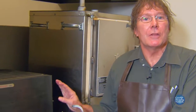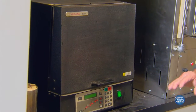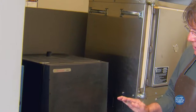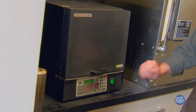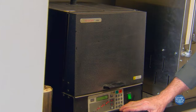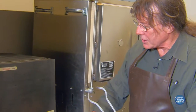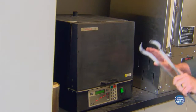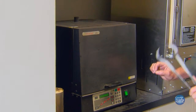We are at our oven. The flask is inside at a particular temperature. To burn out the wax inside the flask, it goes through a series of different temperatures for different lengths of time. It goes as high as 1,300 to 1,400 degrees — depending on what you're casting — which totally burns out the wax, leaving no residue. Then you bring it back down to around 900 degrees. We're going to be casting 14-karat yellow gold, and for the size flask we're using, a good core temperature of the flask is around 900 degrees. We're going to use the tongs, grab our flask, and take it over to the vacuum casting machine where we will pour the molten gold into it. Let's go ahead and get it out of the oven.